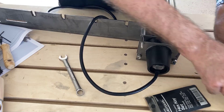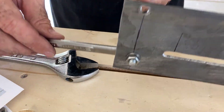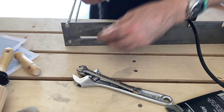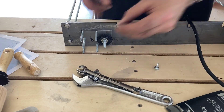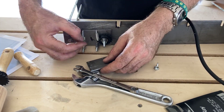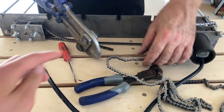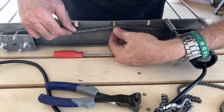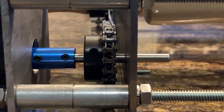Now I'm tightening up the motor mounts. The sides of the machine are just threaded rod — you can see one of the sides going on right now. How are you going to put on the chain when you've already put the gears on? Great question. What you see here is the gear tensioner — essentially two loops, one around where the motor is and another on the tensioner side. The chain comes as one long strand, and there are special links that relink the chain in the middle. I cut it to the right length and use that special link to close it. If I ever need to take off the chain, I can remove it from the motor side.